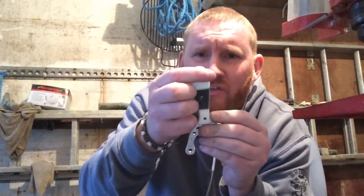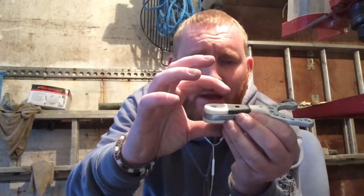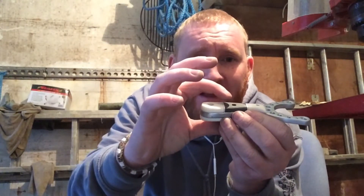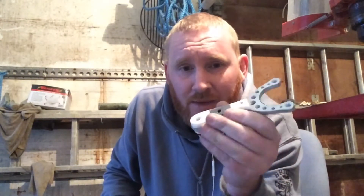Back, all shaped up. Another thing I'm going to say is I don't always shape up before I pin. On Stanley frames I never do — I only ever do it on Millbros. I don't suppose it saves time or makes any difference. Originally it was because the first Millbros I'd done, I scaled in quite big material, so I found it a lot easier to shape down without the pins and then having to shape metal pins down as well. I've just stuck with it. But you could pin it first, then shape it in — makes no odds.